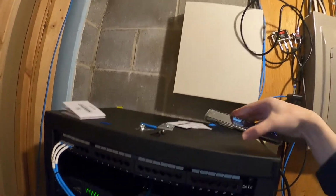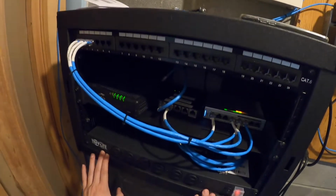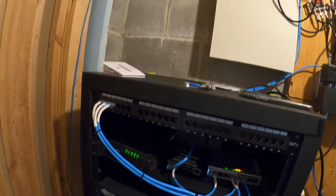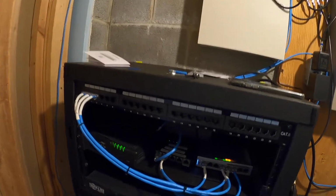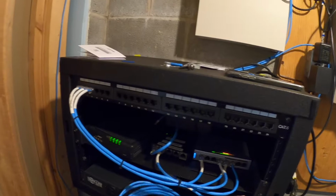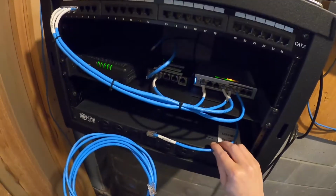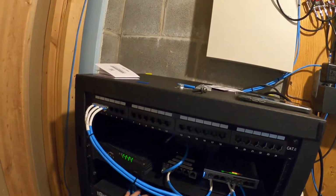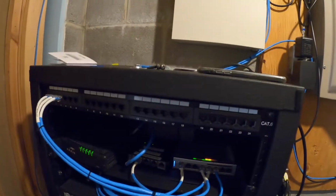So just as a service thing, I love to install the RS-1215 because you have 6 outlets. So if you ever have to come down here and work on something, you have outlets available to you. I also like to make an additional network cable and a little patch cable, just to make sure that if you do have to come down here and plug into anything, you can.